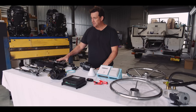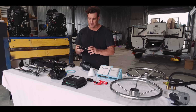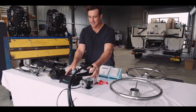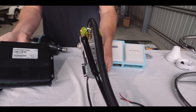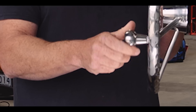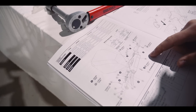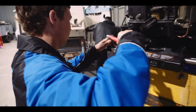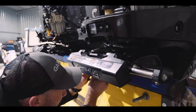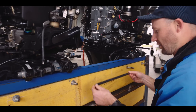The SCU — steering control unit — can respond to inputs from an autopilot. In this case we're using a component called a NAC-D, which is unique to the Simrad system. This little part replaces almost everything from the old setup — about the only part that stays the same is the steering wheel. The actual installation of the electronic actuators was quite simple with the diagrams provided. Bullhorns go onto the steering ram, and the steering ram bolts up through the tiller bracket — a very similar fit-up to a standard hydraulic ram, only with no oil.